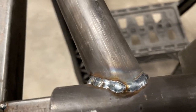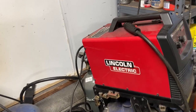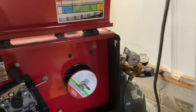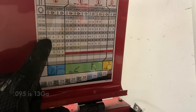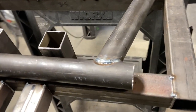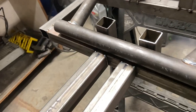You don't want water to get in there and rust your tube from the inside. I'm using a 110 MIG welder — Lincoln Electric 140 HD Weld Pack. The reason you can get away with this is we're not using very thick wall tubing, about 14 gauge. I weld on setting C — not even at full power. A tip if you're new to welding: set a pace for good penetration, keep your glowing red glob going with a consistent crackle as you weld.